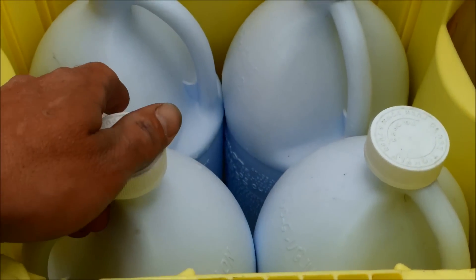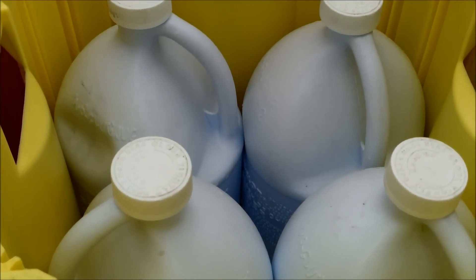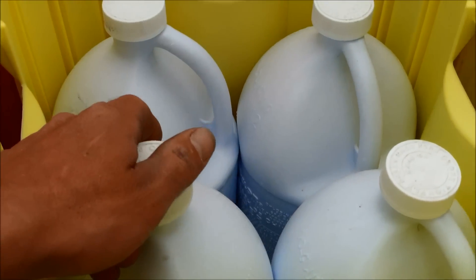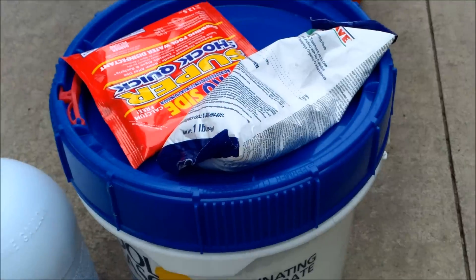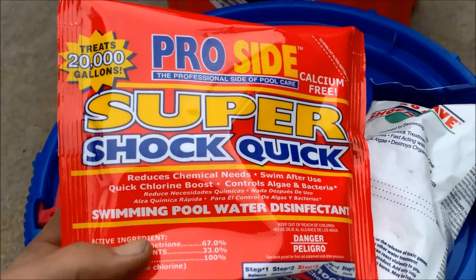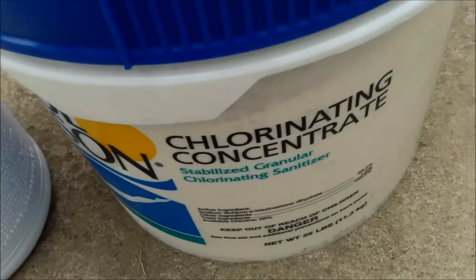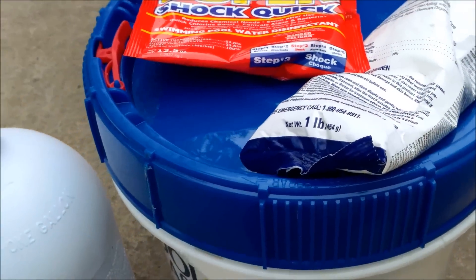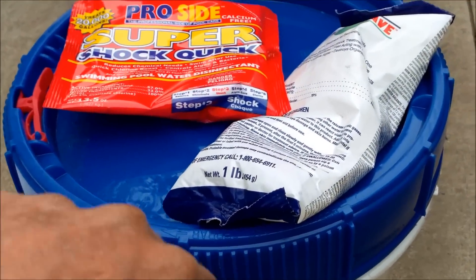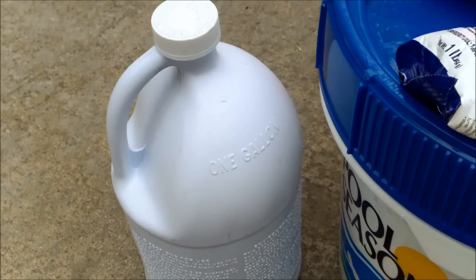I really prefer using liquid chlorine when I use the Yellow Treat, Yellow Trine, or Yellow Out — it reacts much better in the water. So whether you use Cal Hypo Shock, Trichlor Shock, liquid chlorine, or granular chlorine, you definitely have to use a sanitizer in order to keep the algae from blooming. You want to keep the chlorine level at least 3.0 or higher during the treatment process, and you definitely need to super chlorinate your pool based on how many gallons it is.